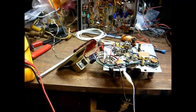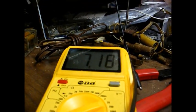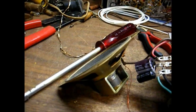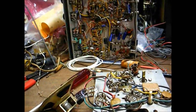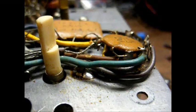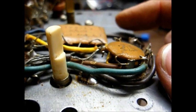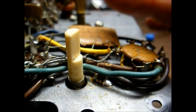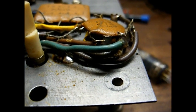After more warm-up time, as you can hear, more distortion. Our control grid voltage on the audio output tube has gone up a little bit higher. Generally, that's what happens with these gassy audio output tubes — they'll sound reasonably well at first turn-on, and then they warm up and rear their ugly head. So let's find a good 50C5 and see if that'll cure the problem. If the tube ends up not being the problem, the trouble will most likely be the internal coupling capacitor inside of this couplet here. They don't go bad much, but it does happen. But first we're going to replace the tube and see what happens.